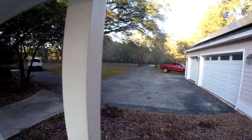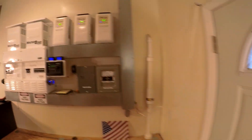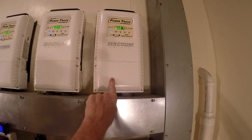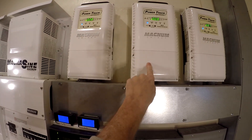We're only on January 11th here, and around 1 o'clock this tree is going to shade the main panel. It's close to the shortest day of the year, so not the best time to do a test, but we'll do another one in a few months. The ground mount array is on this charge controller, and the garage is split into two arrays — the top row and the secondary row.